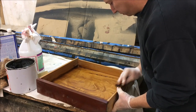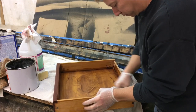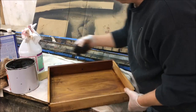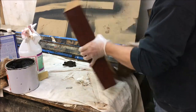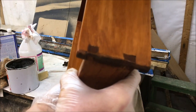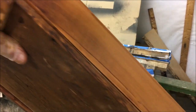The final step is to wax the entire piece. On the inside of the drawer I'm going to use paste wax with steel wool and rub down the entire inside — this will darken up the inside of the drawer and make it look kind of dirty and old. After buffing it out, you can see it looks kind of dirty and worn, and where I did the touch-ups it just looks like dark streaks in the wood. I darkened up the dovetails on the end there as well.